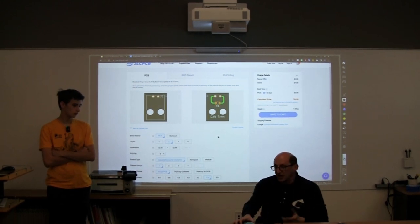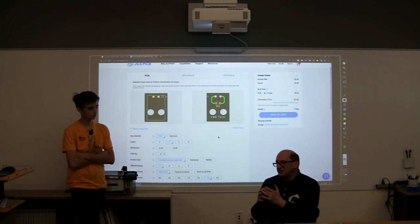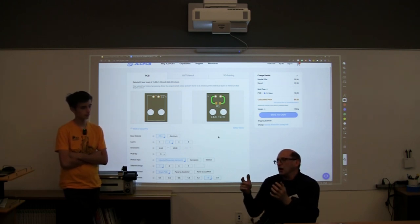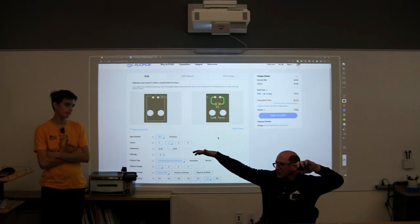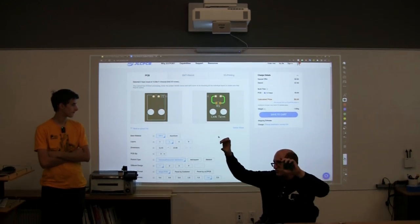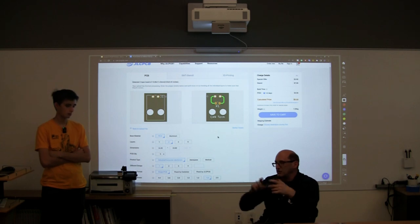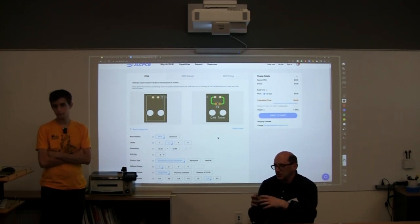That's another reason for building boards versus wiring them up on breadboards: when the speeds are high, you end up with a lot of inductance, and that's kind of your enemy. You'll end up getting ground bounce, where something is sending a 0 to 1 to some receiving circuit, and because you've got a lot of inductance, the voltage moves around on the power supplies. When it should be seeing a 1, it doesn't see it because the ground moved. That happens when you don't have a very clean path for how the return currents flow. And circuit boards help with that.